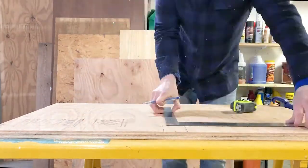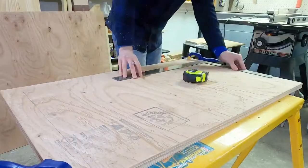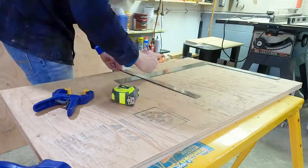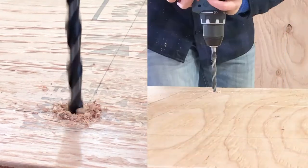This is half-inch builder grade plywood, and here I've doubled up the front and back faces of the frame so I only have to make one set of cuts and hopefully they'll both match. Now I'm marking off 2½ inches all the way around the frame that will ultimately hold the concrete, and drilling some pilot holes so I can use my jigsaw to cut everything out.